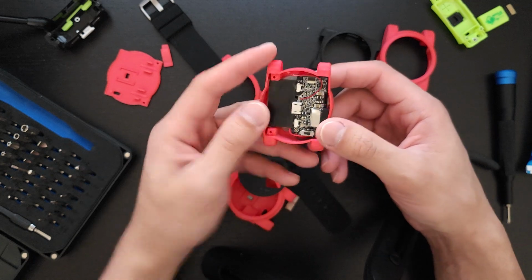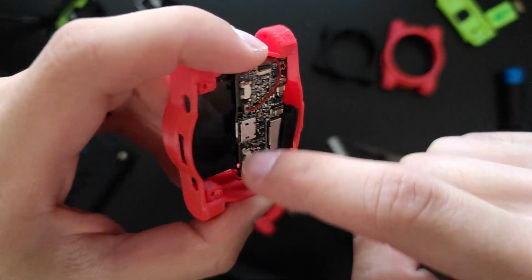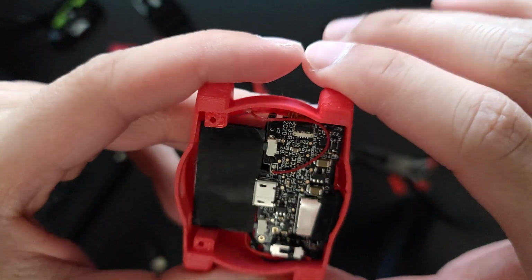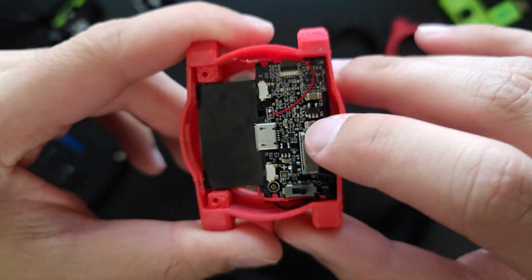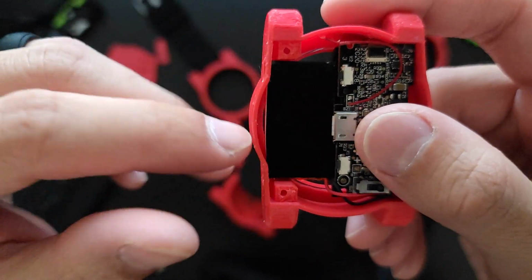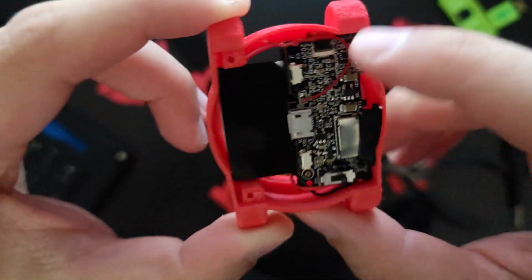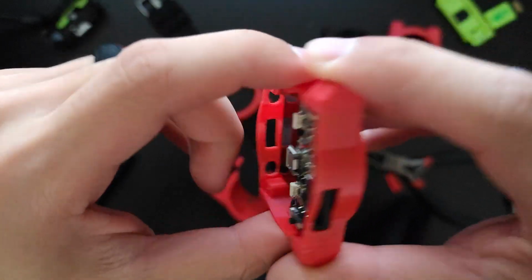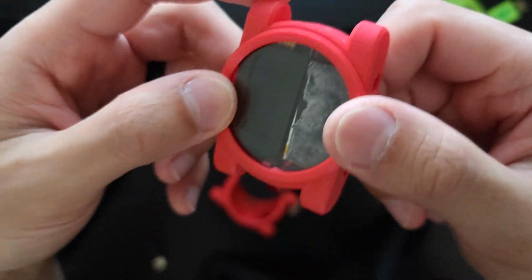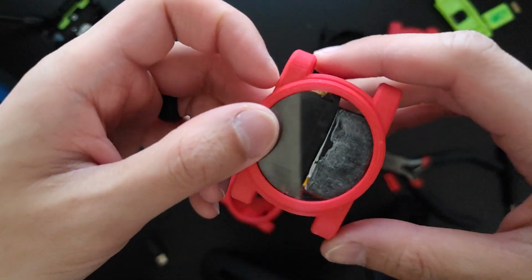On that note, while we're talking about things to find, if somebody can find a wireless charger that is micro USB, like a wireless charging coil, like the little copper coils, that talks directly to micro USB, that is less than 40 millimeters, I would deeply appreciate that, because I really want to add wireless charging in here. But every wireless charging kit that I've seen that is small, this body is about 45 millimeters. Every one that I've seen is one that you directly solder into, or it comes with an extra board or something like that. I think wireless charging would be really sweet in here, but because this is a drop-in conversion kit, I can't count on anybody doing any soldering, so that's just not going to be something that I can give to people without the proper things to source.